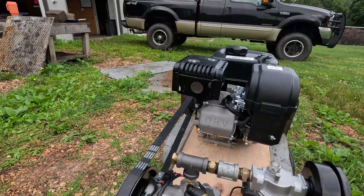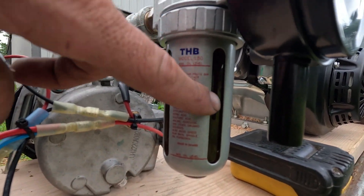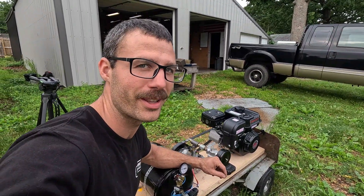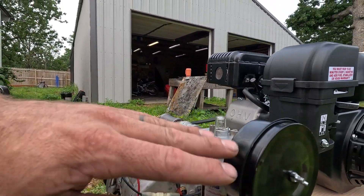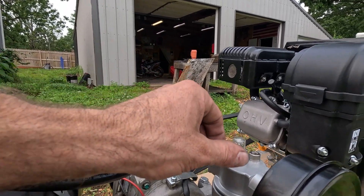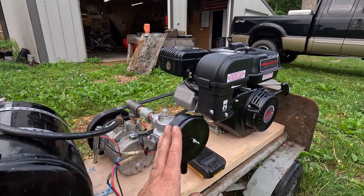The system I've come up with — and I'm sure others have done this — involves an oil regulator on the inlet side of the compressor. It is currently filled with 10W-30 oil. That is not the ideal oil; it would probably be best to use PAG oil, which is the original type used in your AC system, and the next best option would be air tool oil. But I've got lots of 10W-30 around so that's what we're using. As the compressor sucks air it will also draw a small amount of oil. There is an adjustment on this regulator, and on the inlet side I have an air filter installed so we're not sucking in nasty air.